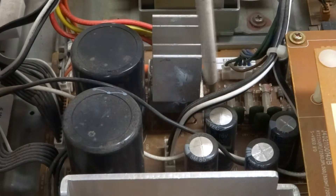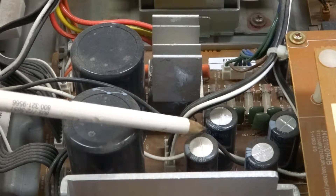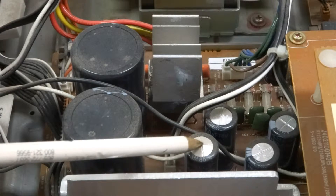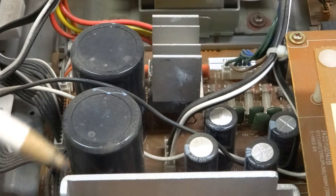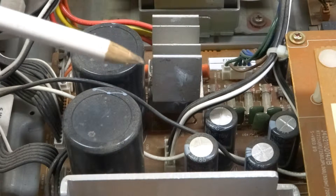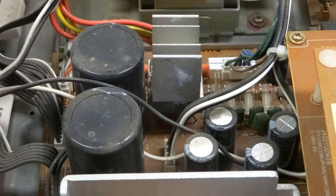There's a row of fuses here — I'll definitely grab all of those assuming they're good. There are a couple more over here under the upper board. Down here you've got some filter capacitors on the DC side, and it's not really showing up on video but these two right here are bulging on top — they're not smooth and flat like the others. My guess is the previous owners probably ran this receiver pretty loud and really stressed the components. They're no-name capacitors, YEC brand, never heard of them. Being that this was apparently college student owned, I'm sure they pushed it to its limit.